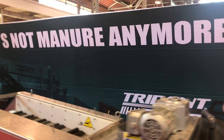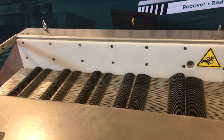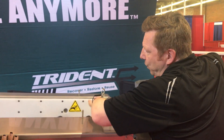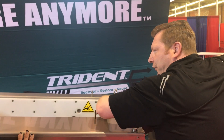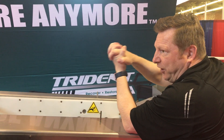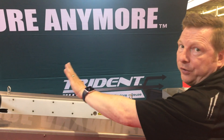The manure is going to come into what we call the wave separator. The core thing with the wave separator is that it literally looks like a wave as it goes through. The manure starts very thin, and as it waves through the polymer is going to bind it together through positive and negative charge. As it attaches and grips the particles, we get to about five to seven percent solids closer to the end.